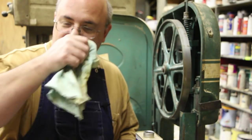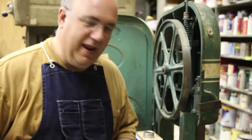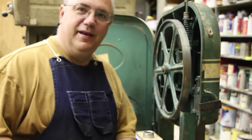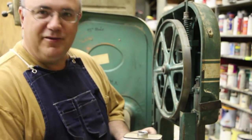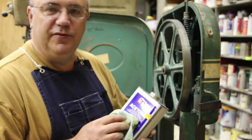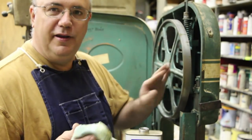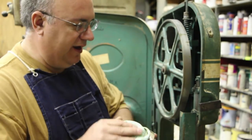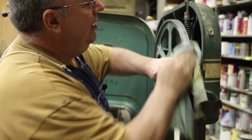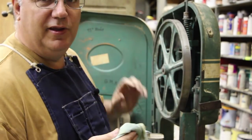We've got a pretty nasty front coming through, so you can probably hear the rain on the roof in here right now. Fortunately, I'm out of the weather. Maybe the thunder and lightning won't get too bad. Back to the project here — I did a little experimenting, and I got some acetone. I tried a couple of different solvents, and acetone seems to be removing this glue on this wheel pretty good. So I'm just taking a clean rag here and going through here and wiping this off. I'm having to rub in some spots pretty hard, but it's taking it off real nice.